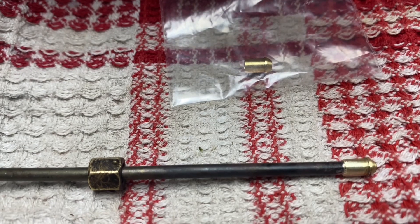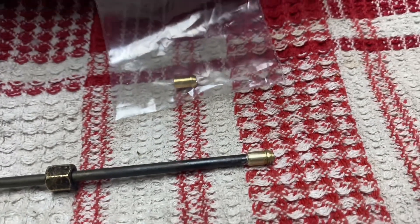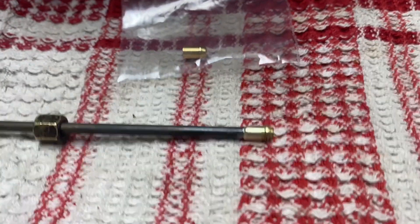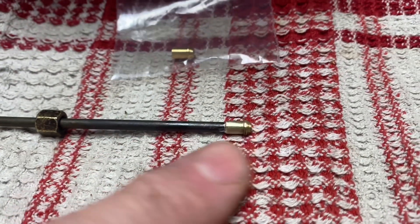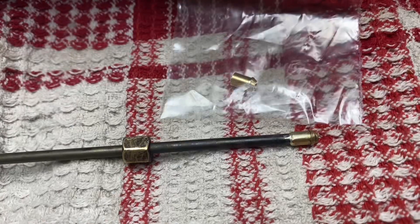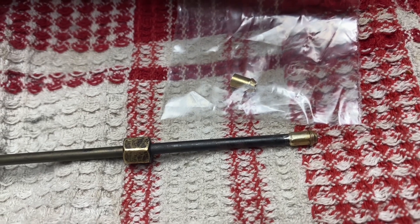Keith, being a brilliant machinist, took some careful measurements and made two nipples. Then we attempted to hard solder it on there, and well, that didn't work — we had all kinds of problems — because this is steel, this is brass, and you need something that's really high temperature that's going to stay on there.